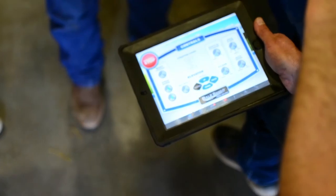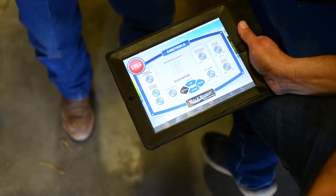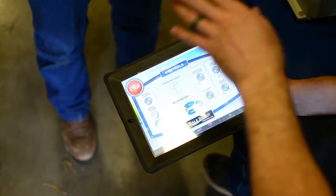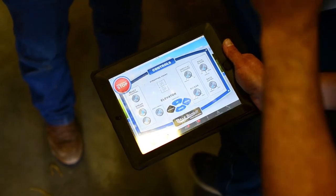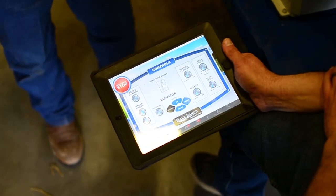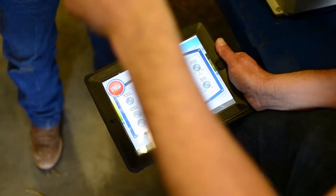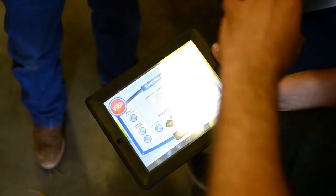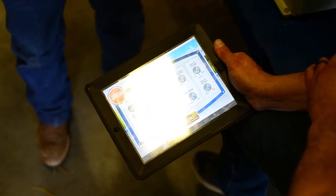I thought I solved the problem — the whole time I thought I knew where the problem was. Those don't line up. I can fix it right in the field — wrong problem. But that's why you get the monitor. Use the monitor, then use the red and green lights to decide how it's thinking. There's no problem on here that you can't isolate and fix, because it's always the step before that screws up the one after. The machine is smart enough to say — hey, I'm not going to turn myself up, I need this input — and it's going to stop and ask for it. When people start manipulating the machine to make it do what they think it needs to do without giving it its input, that's when I've got a whole bunch of stuff to fix when they call me.